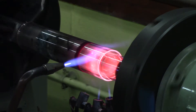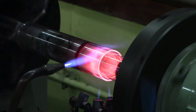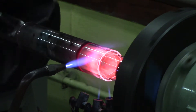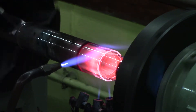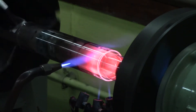During this time, I'm going to let the glass gently sag in a little bit, then gently blow it out. I don't want a ridge on the inside, and I certainly don't want to catch that quartz on the outside. I want the glass to entirely cover the sapphire surface and avoid any kind of sharp angle on the inside, as that could indicate an incomplete seal.